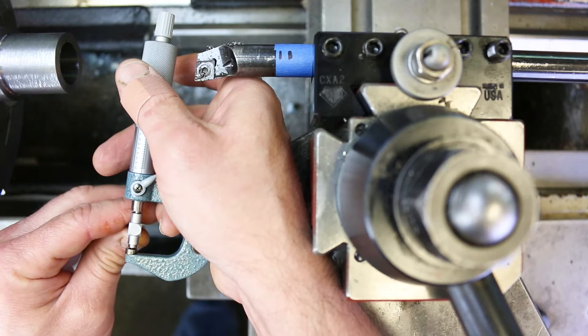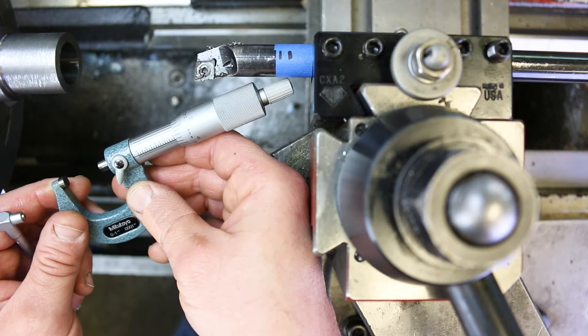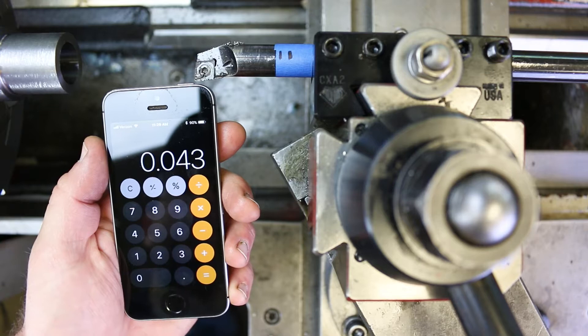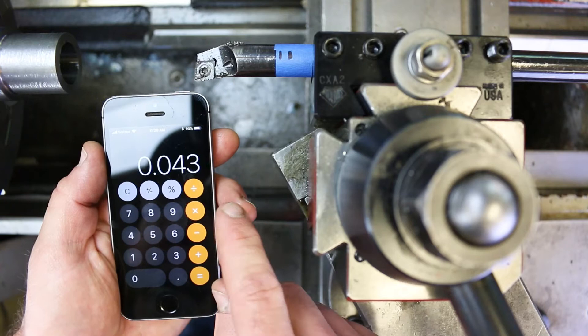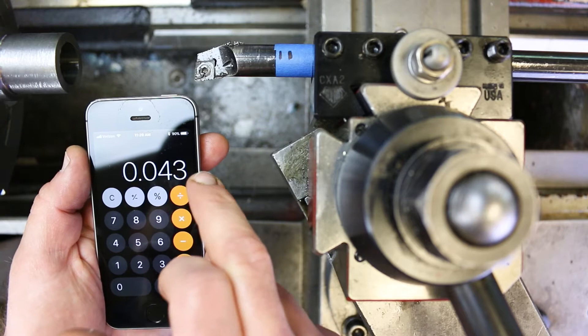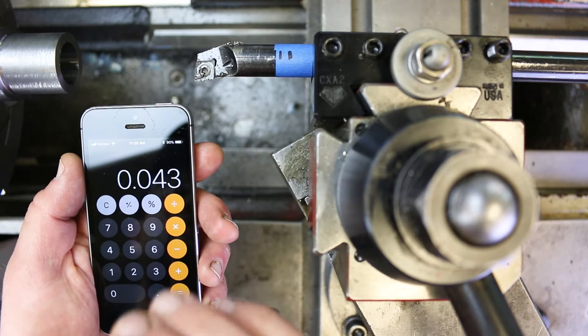That's telling me 832 thousandths. We're shooting for 875 and we're at 832 right now, so we've got 43 thousandths left to go. I took a cut of 20 thousandths at a 3 thousandths per revolution feed rate and it came out perfectly. I'm going to try to recreate that — take maybe two more cuts, considering this to be within the finishing range for this diameter. I'm going to take another cut of 20 thousandths and see if the diameter changes predictably. If I tell it to take 20 and it takes exactly 20, I know I'm good to go and can trust the machine adjustments.